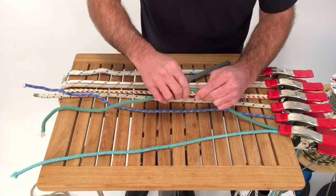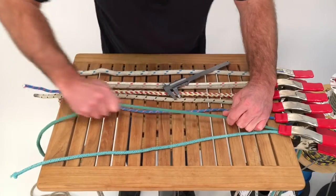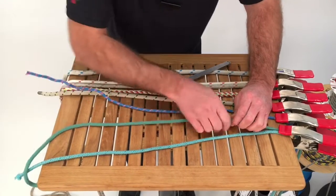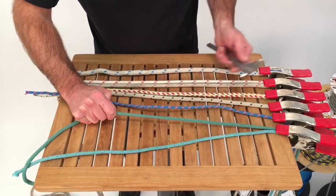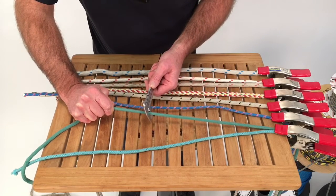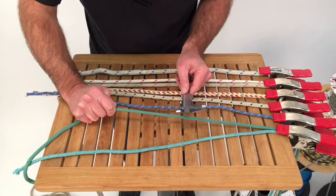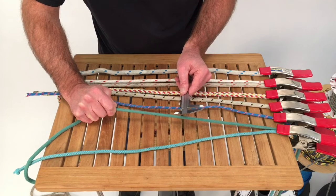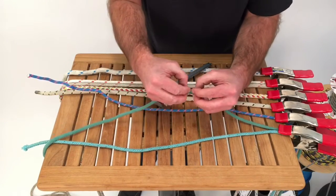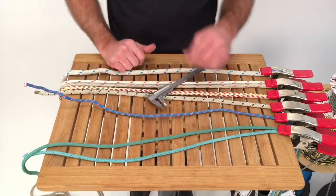This line feels like it's got a lot of damaged fibers in it. It feels like it's been pulled back together and the braid might have inflated a little bit. So I'm going to work hard to get the braid angle down, get the constructional diameter out of there. So I've got that under load. Open this up, long ways, rotate 90, and off. And that's, well, that's a good hair over a 1/4 inch, but it's not getting close enough to 5/16. My suspicion going into this was it was so damaged that the braid was coming back together and it was going to be on the large side. So that's not surprising, and I'm confident that was a 1/4 inch or is.